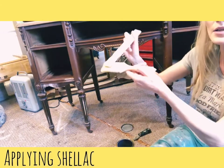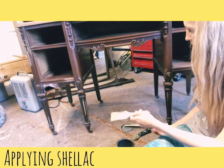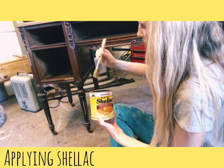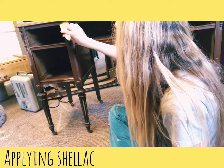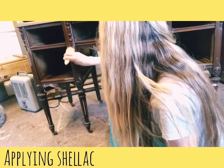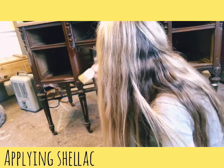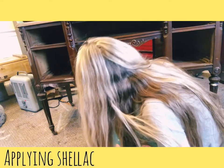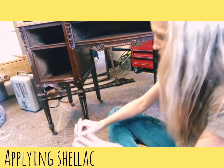I'll stir up my can of shellac — it is a little stinky and has an amber color. It's translucent but has a slight tint to it. Dip the brush in and apply a thin layer — you're just creating a barrier between your paint and the furniture. Don't go overboard, because it will drip and run, and if those drip marks dry they'll show through your paint. It goes on very glossy so you can easily see where you've applied it. It dries super fast, usually within about half an hour.